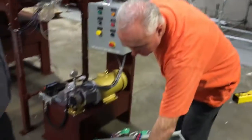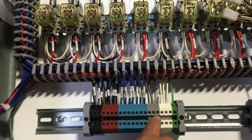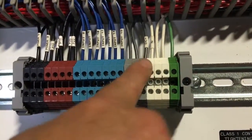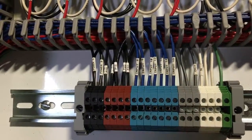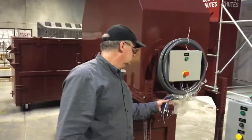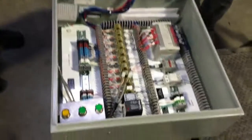Question: if there are three whites and three grays here but just one white and one gray wire, look down here — you can see these little metal stubs in the middle. What those stubs do is take all the gray ones and tie them all together, and all the white ones together. There's nothing bridging the blue ones because each one of those blues is different. So just hook up the colors — white can go to any of these white terminals, gray to any of these gray terminals. There's only one green terminal. Then for the blues and blacks, you have to match the numbers — number for number. Do white, gray, and green first, then blues and blacks. Double-check and triple-check them to make sure they're correct.